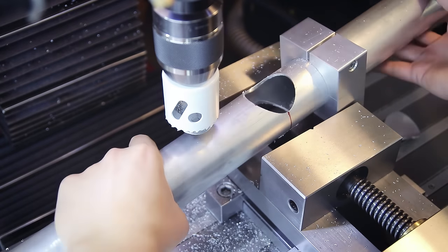Next up is this little connecting piece, which might look a bit weird at first. There's a reason I picked this oval-shaped tubing profile — there's not a lot of space down here to integrate the motor into the frame, and this creates some clearance while being a lot stronger than a piece of round tubing with the same thickness would have been.